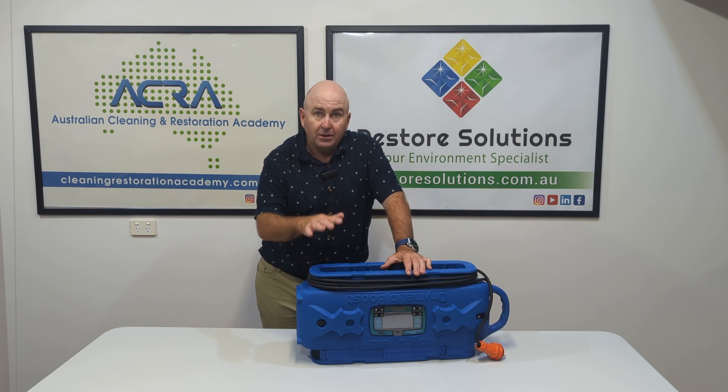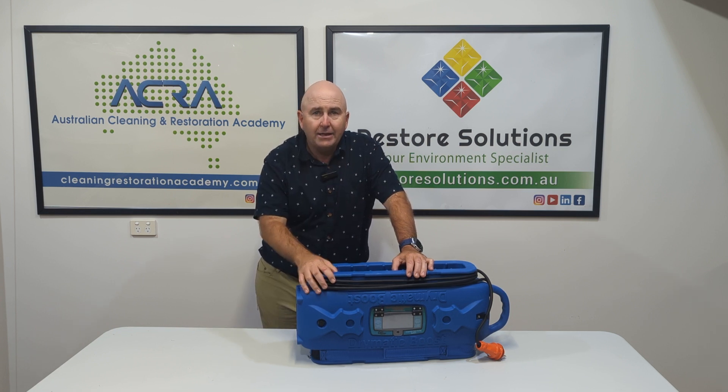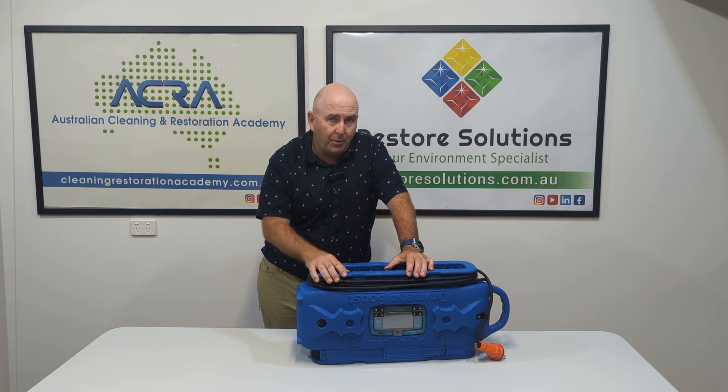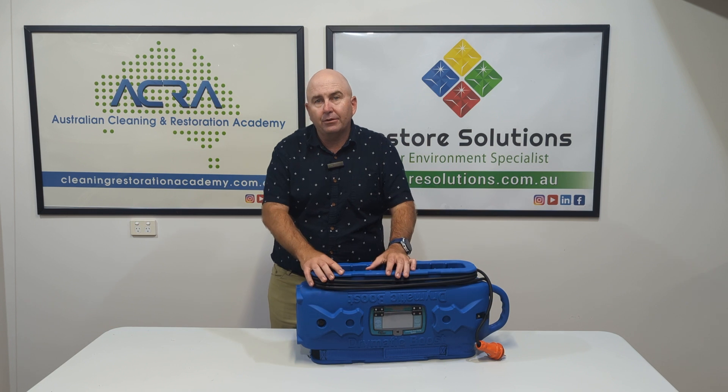So, turbo boost with any attachment. People say to me when I'm drying under the house or in the house and I'm doing some drying, they go, under here is still wet, this bit is still wet. I'll say, is there heat coming out of that pipe? Yes. Aim some of that at it. Well, can you aim that at it and blow it into a mat, or aim the pipe at it — how can you get that heat as close as possible to the materials?